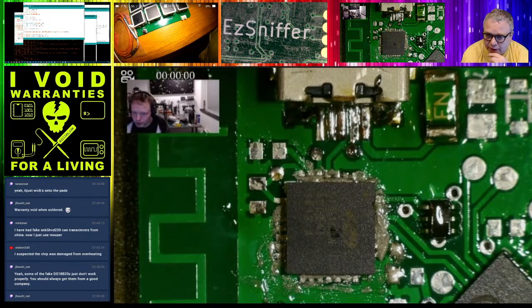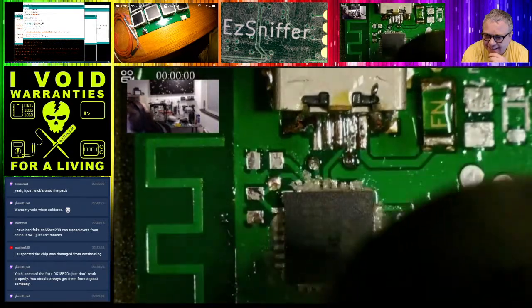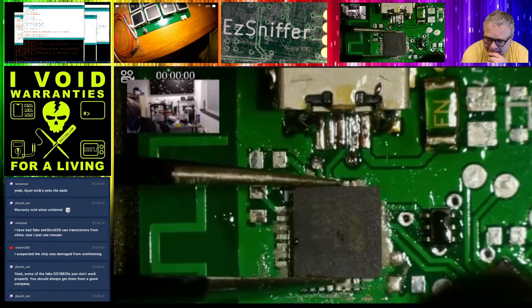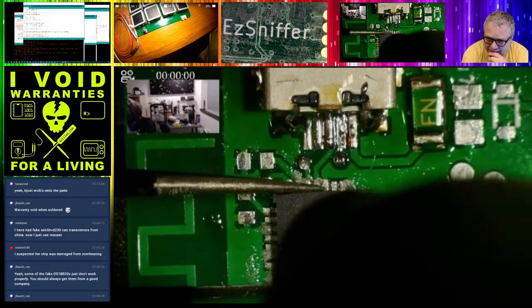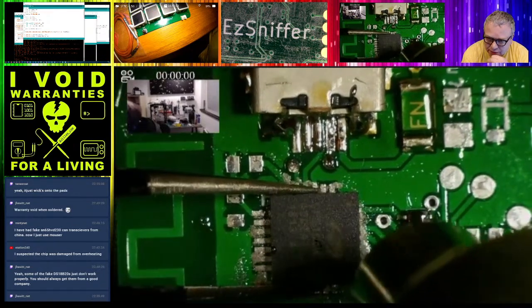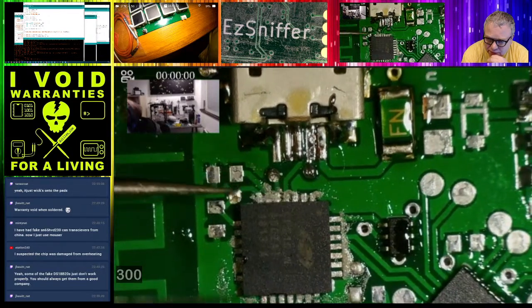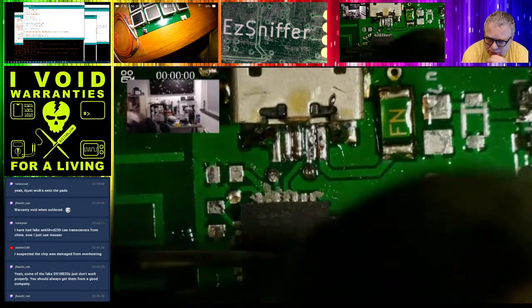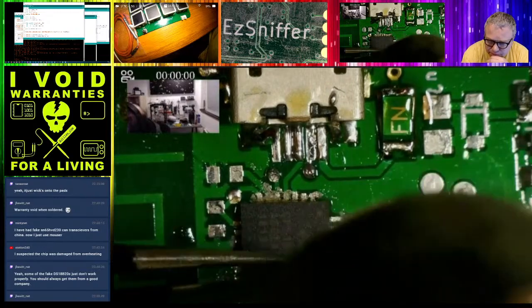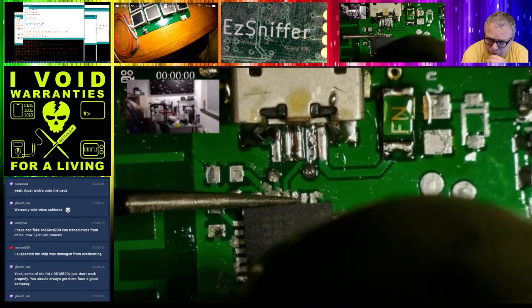Okay, so it's really a joy to watch this. I'm going to slowly just move across it. You already see stuff moving. Oh! I blew it away. Let's keep it just a little bit more in spot. So what's the temperature? I'm currently heating up to about 300 something. I think I don't have enough solder paste on here.